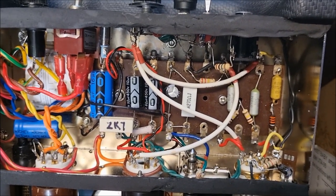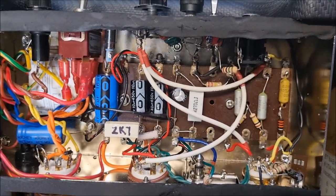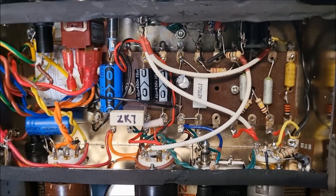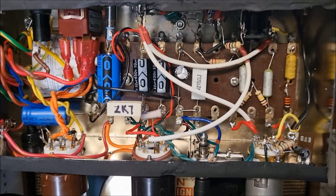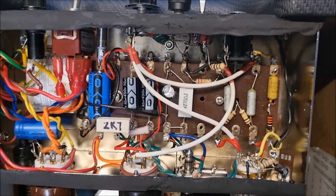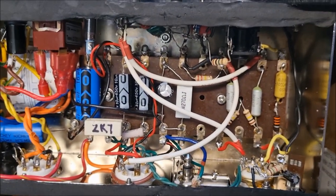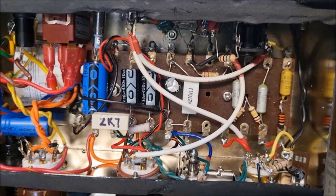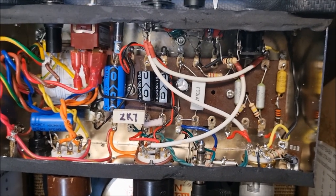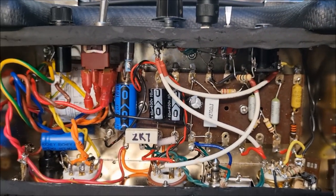As a little experimentation taught me, it is better to have all your preamp grounds going to one point, even if it means running a wire from the 12AX7 socket to the other side of the chassis. Just run it, as I've done, in the corner, close to the chassis. And again, big thumbs up, because that produced another good reduction in the amount of hum.